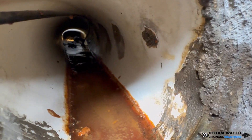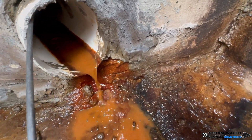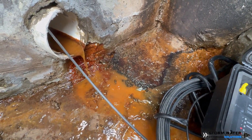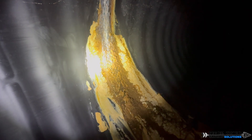This obviously causes clogs and other issues to occur in that drainage system. In this particular storm box, you can see that I'm running my camera inspection snake into this six-inch perforated PVC French drain and I'm stirring up the iron ochre that is in the pipe. I could not get my snake very far because this pipe was pretty clogged up with iron ochre and it was hardened. Here's a pretty interesting example inside a large dual wall mainline. This dual wall pipe is slightly damaged and you can see where the water is oozing in and the iron ochre is just dripping and forming down the side of the pipe — showing how it can get into a plumbing system through even a small hairline crack.